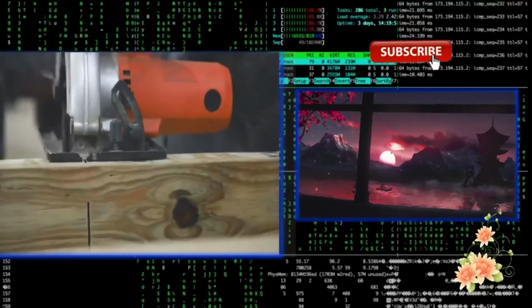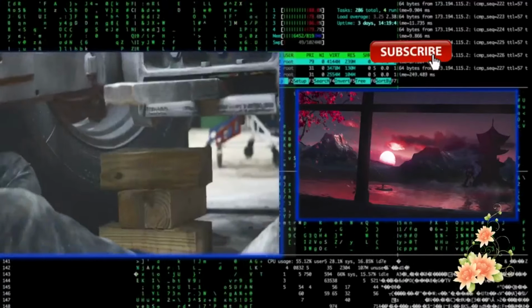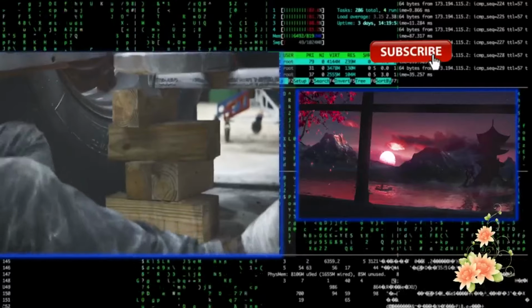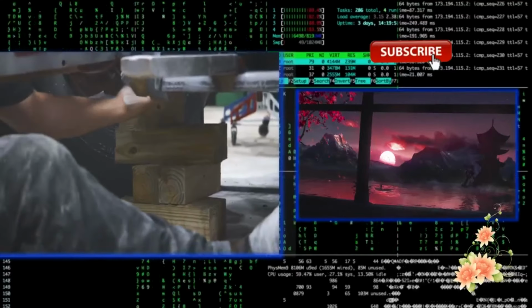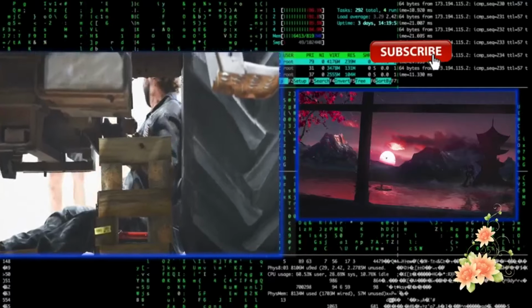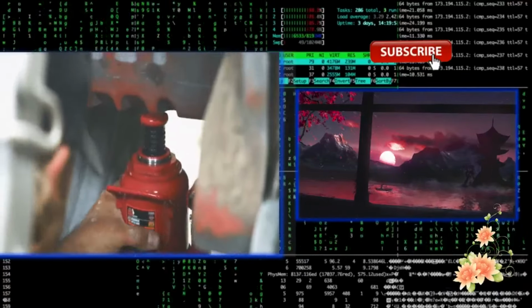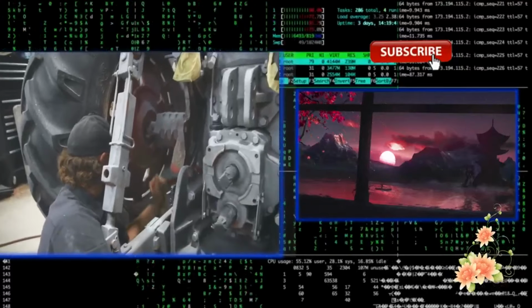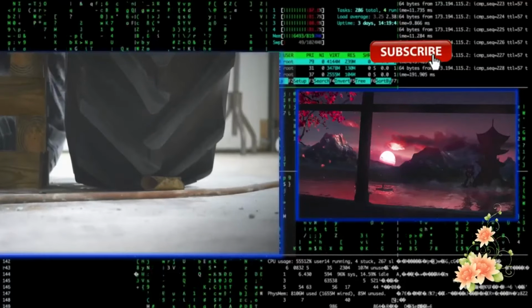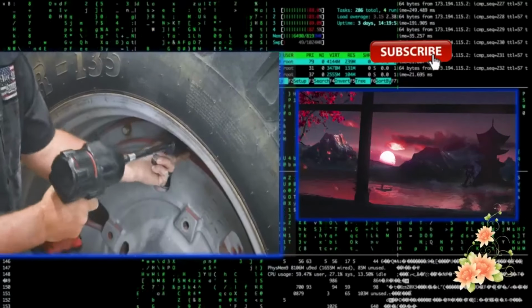Right now we're playing Jenga. We got some treated 4x4 posts and I'm cutting blocks out of it. And we're going to stack blocks, I don't know, 1.5 feet high at least, then jam in a bottle jack. Try to not make it lean any direction. Bottle jack it to where we can get this tire hovering, and then try to slide this off without it toppling over. It's going to be a good day.